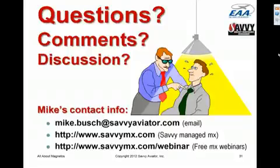Okay, and Brian has 2 slick mags that he hasn't used yet. Are the carbon brushes something I should consider replacing with new? How would I know if the brushes are like the ones that you referred to in the presentation? There's an AD, and the AD has a specific applicability section that gives dates during which, if the mag was either manufactured or rebuilt during a particular date range, then it's one that might have the bad brushes, and gives inspection procedures for opening up the mag, looking at the brushes, and seeing if you've got a bad one. So you just need to pull the AD. I don't have the number at my fingertips, but it's easy enough to get with Google, and take a look at the AD and follow it.